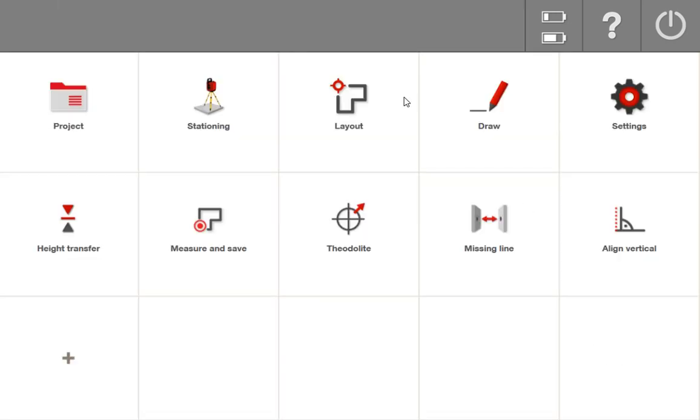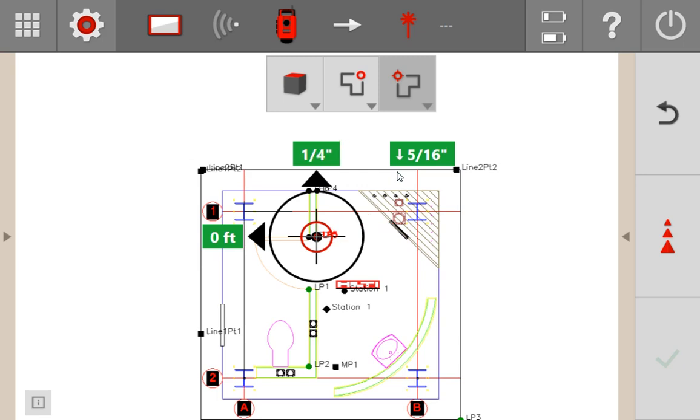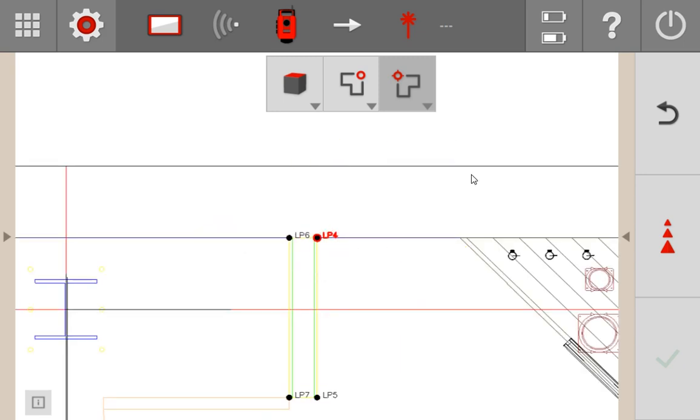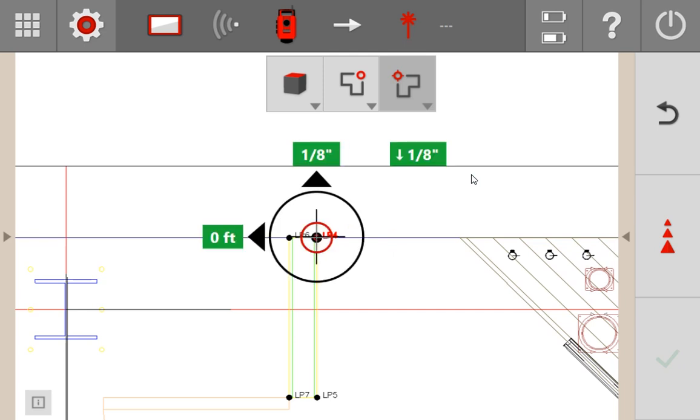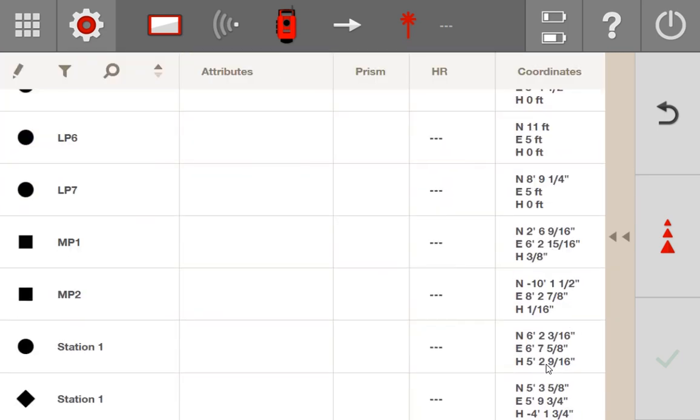When I go into layout and lay out one of these points — say point 0.5 — it turns to the point without asking for a benchmark height measurement, because it now knows where 0 is, and it turns straight there and gives me my measurement. I'll go to 0.4 and it's that simple. The height value is measured in at the very beginning, and the tool goes to that height value along with the north and east values, letting you know with three coordinates how close it's getting to that point. Keep in mind, if you try to lay out a point with a non-zero height value — like that station point at 5 feet 2 and 9/16ths — it will actually turn to that height location on your job site as well.